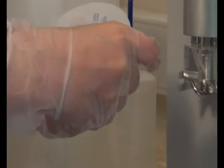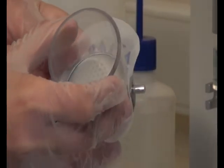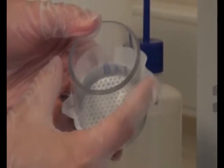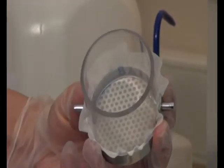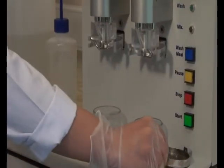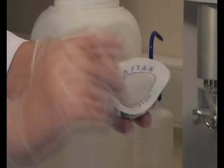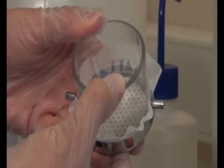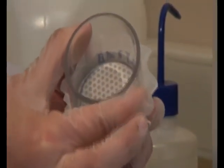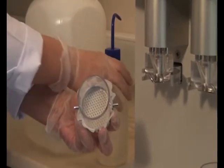Place a silk sieve between the perforated pallet and plexiglass chamber and smoothly stretch it. Then, fix the plexiglass whilst turning on the perforated pallet. Apply the same process for the other washing chamber. After this, moisten both of the sieves inside the washing chamber with a washing bottle.